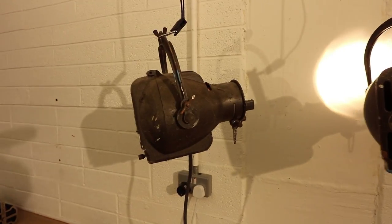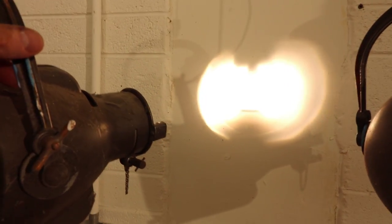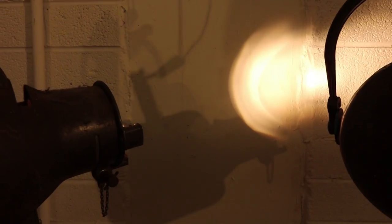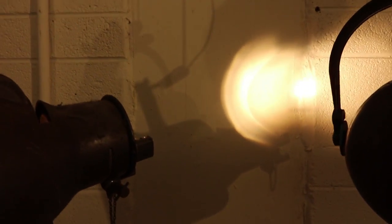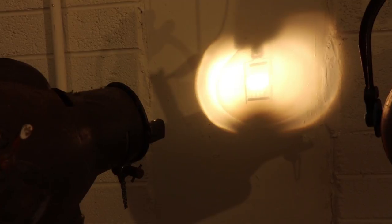They're very, very hot. The level of light this beam produces, measured at about 5 meters, is about 1,300 lux — which is not bad, but for a 550-watt light it's not very good. So let's switch on the LED retrofit.